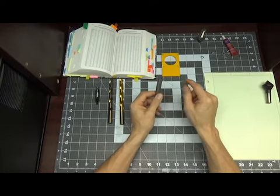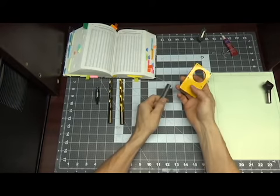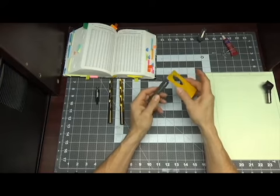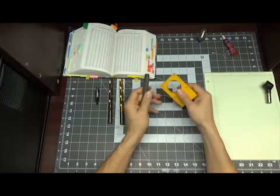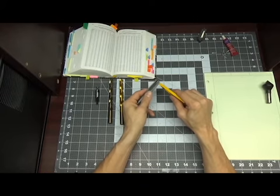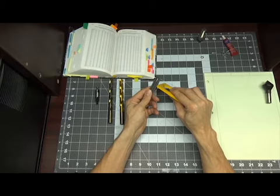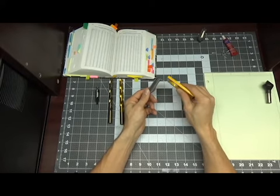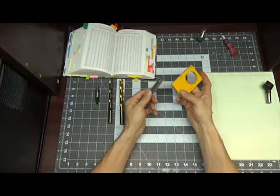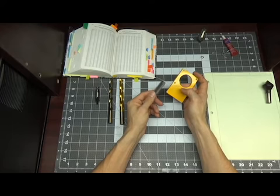And one of the things that happens for through holes is that you can run the tap all the way down to the bottom and you get that even thread all the way throughout, such that you avoid just tapping at the beginning. You should go about this length in, or at least 3 characteristic dimensions in. So what if you can't? For some reason you can't go all the way to the bottom, or there's something else there.